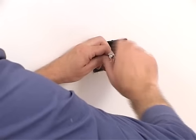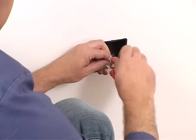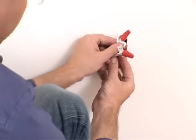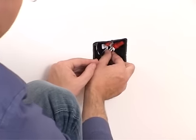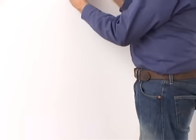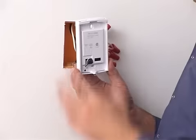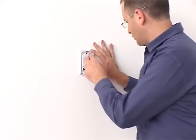In the connection box, connect all the cold leads of the same color from the heating mats. Then connect the same color cold lead from the thermostat to the connection box. Insert each group of same colored leads into one connector. In the thermostat box, connect the wires to the control thermostat according to the wiring diagram in the installation manual and install the thermostat.